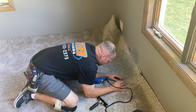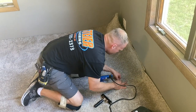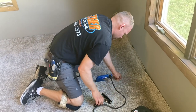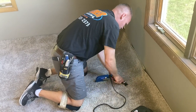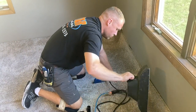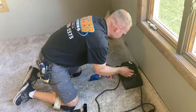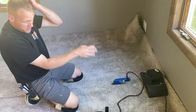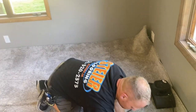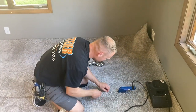So I can tell this is where I'm going to start. Things are going to start moving on me. So I'm actually going to use, because I'm using a conventional iron, I want to keep moving. I'm actually going to use my seamer down now, and I'm going to move this carpet around. That is going to keep my piece from opening up or overlapping. No promises.